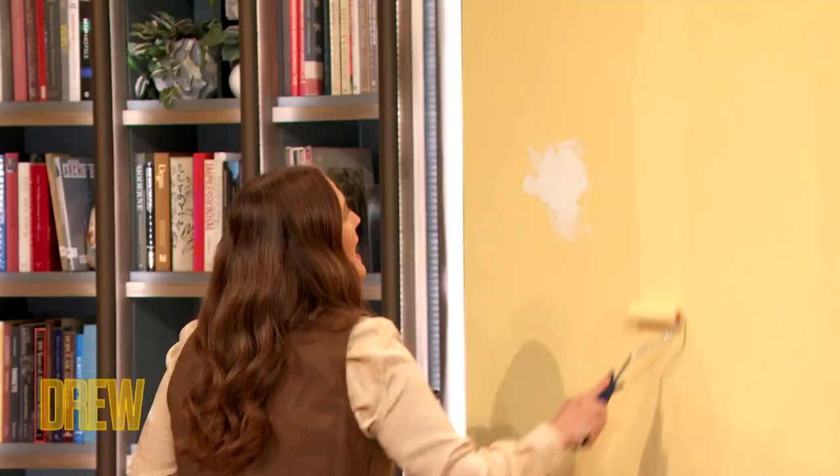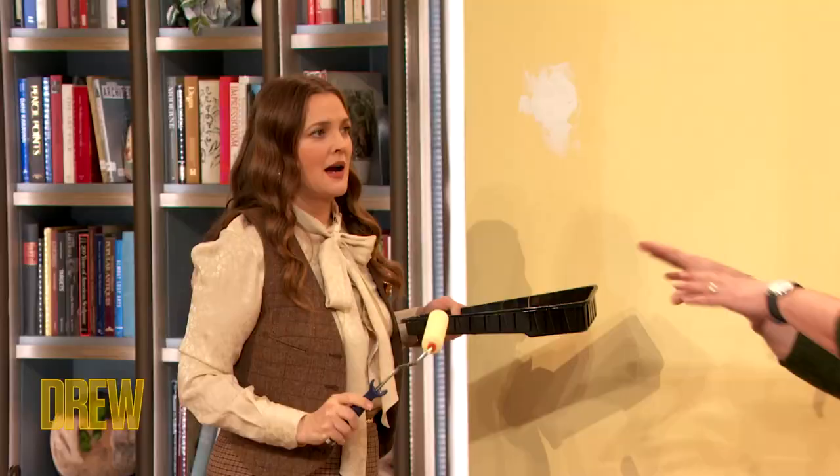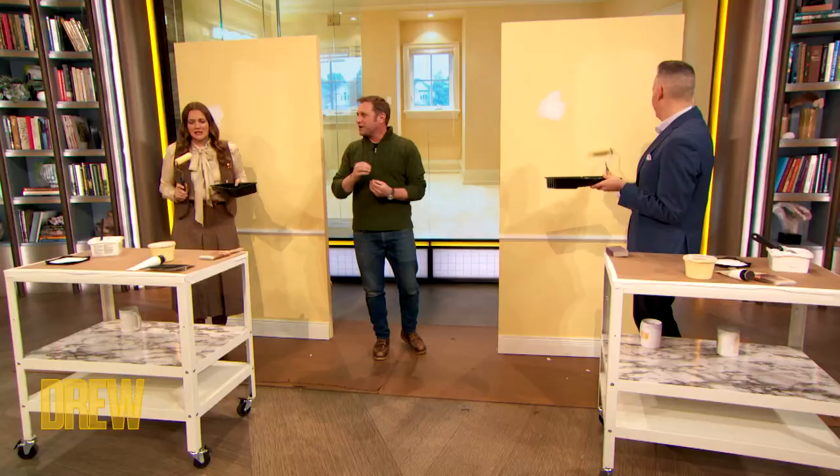I would give it maybe one more pass, but we'll let it dry and then get it with a second coat. And I am so inspired. My second coat's not going well. That's all right — don't press too hard, let the tool do the work. That's another problem with rollers — people push real hard. Let the roller just roll and you'll be good to go. That way you don't get roller marks, you don't get brush marks.